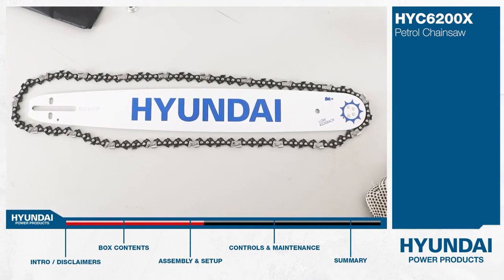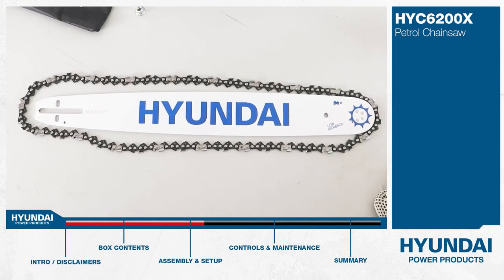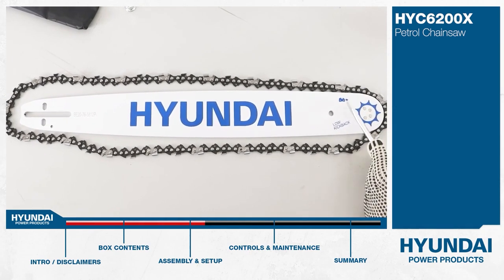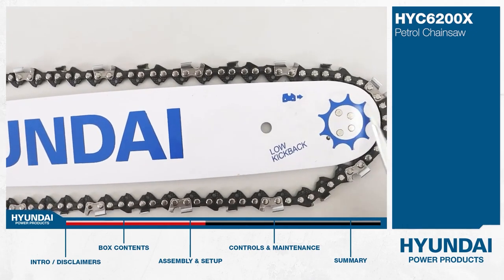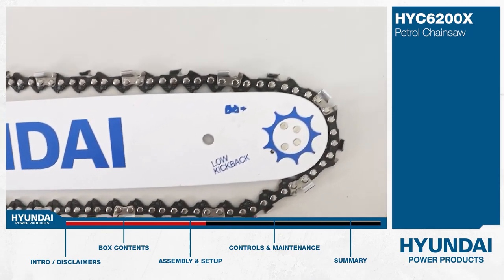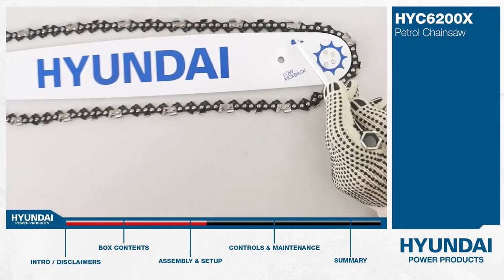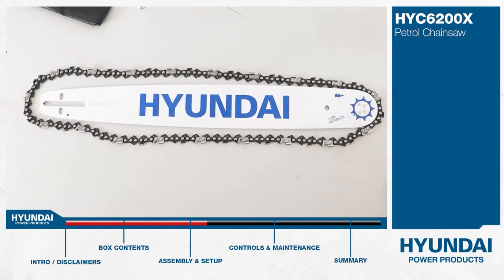So we're going to fit the chain onto the bar loosely first of all, but it's important that we get the orientation of the chain correct. As you can see, I've got the logo the right way up, as you can see it here. That's straightforward enough. Now there's a little symbol here on the end of the blade which shows the direction of the chain, and it shows the shape of the link. So if I look at this silver link here, which is the teeth on it, the shape of this link corresponds to the shape on the picture. You can see the long slopey side, the short steeply angled side, and they do correspond.